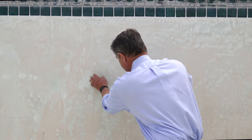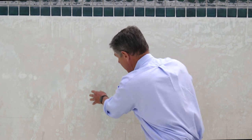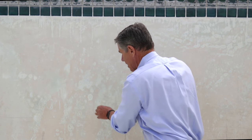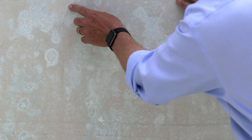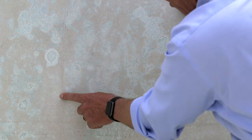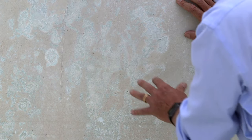But this area is very tight and very solid — there's another nodule here, but there's no delamination whatsoever. It's just that aggressive water is pulling and dissolving calcium out, much like a stalactite. When it comes out here it runs down the wall, gravity takes it, and it re-solidifies. But you can see it in the spot etch region.